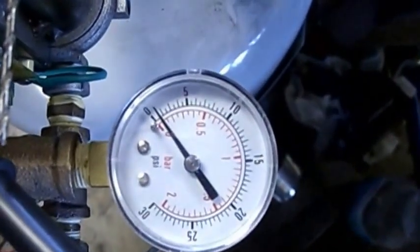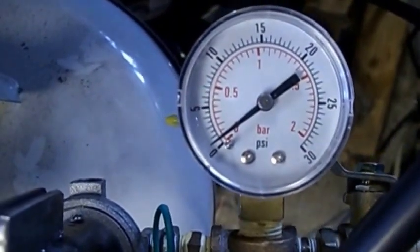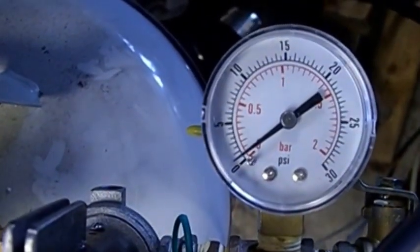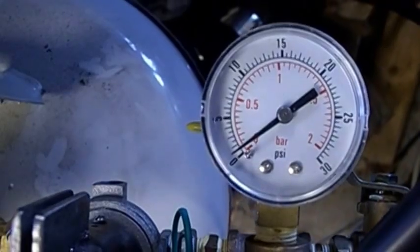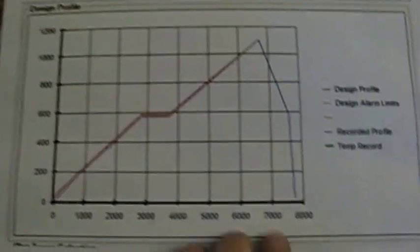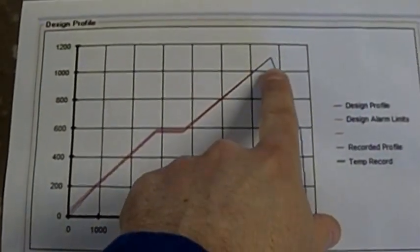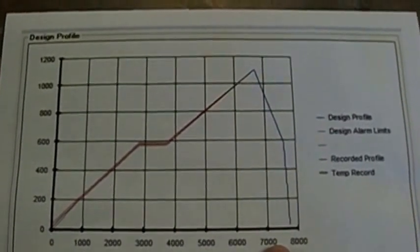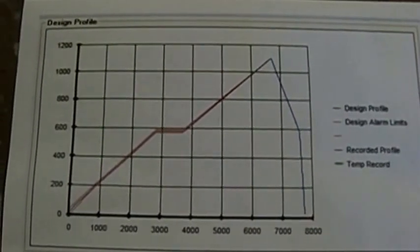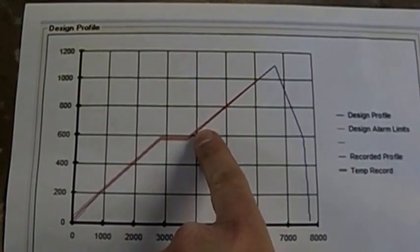Taking a look at the pressure gauge - the needle is fluctuating with the modulation, and you can see that even at 600°C there's just barely a tiny amount of propane flowing. Here's the temperature profile I'm using - it's a very fast profile. Down here this is 7,000 seconds total, so the whole thing is only going to take a little less than two hours to get to the peak. The materials I'm using are very durable and thermal-shock-proof, so I'm doing a fast ramp. We're about halfway done on the profile.